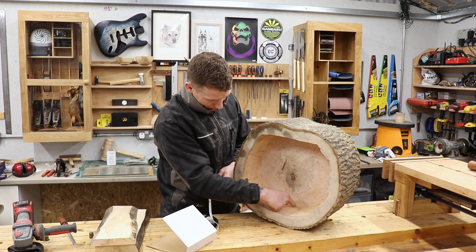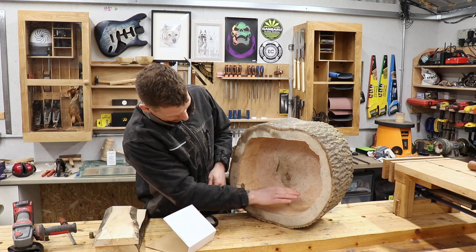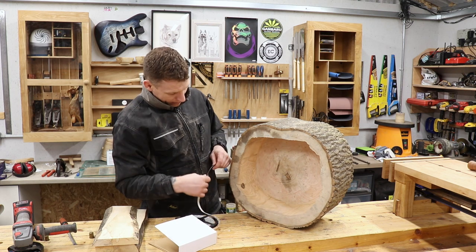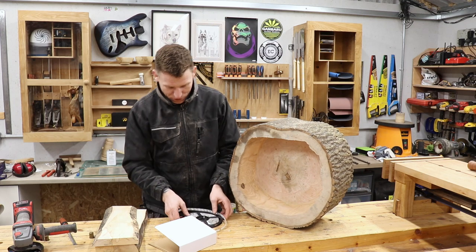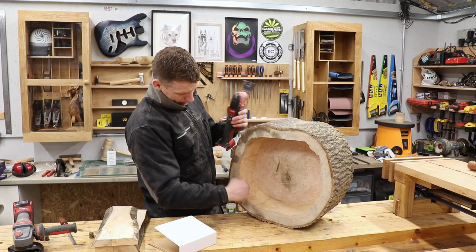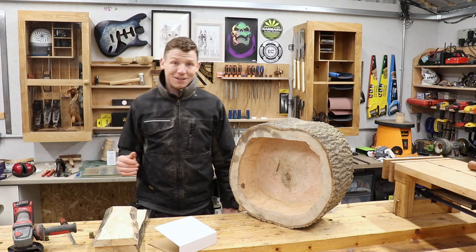I'm going to take the power lead out through the bottom. I'll leave this little indentation on the top to denote the top — so that'll be our top and this will be our bottom. We'll keep this horizontal. It's just a case of tucking this LED strip in around the edge to give it some effect and get our shelf in. I'm going to use the oscillating saw to run a cut all the way around, and then another cut, and then try to take it out with the chisel. That's the approach. So let's get on and do that.